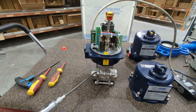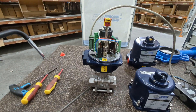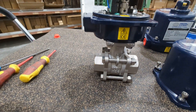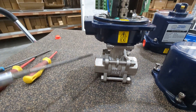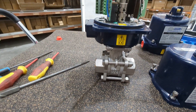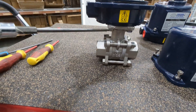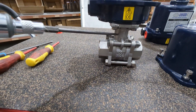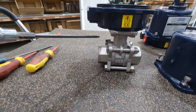The three-piece ball valve is 316 stainless steel and will do 1,000 psi — some of the smaller ones will do higher, but the larger ones will do 1,000 psi. Just remember your temperature versus pressure curve: the higher the temperature, the less the pressure. It's got an ISO pad mount which lets you direct-mount the actuator, and it's got an FKM seal and reinforced Teflon seats with a glass filler to make them stronger.